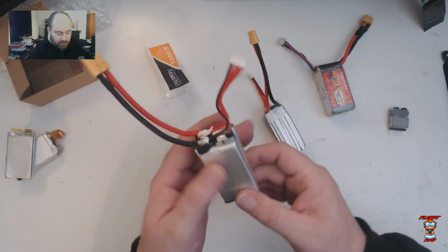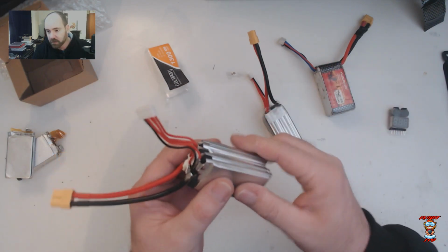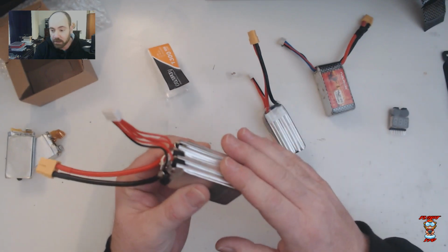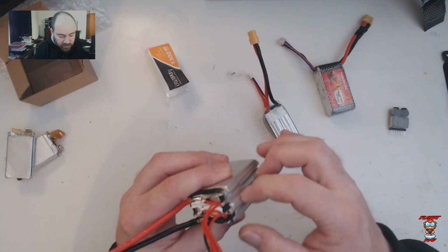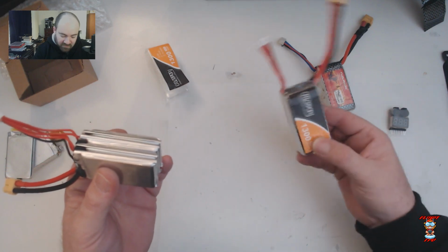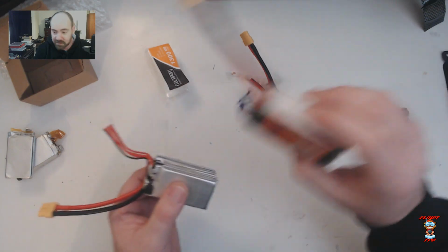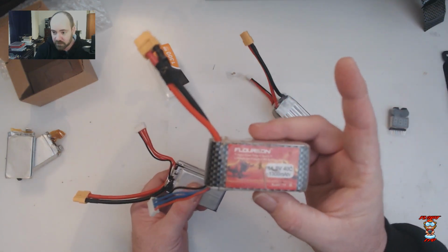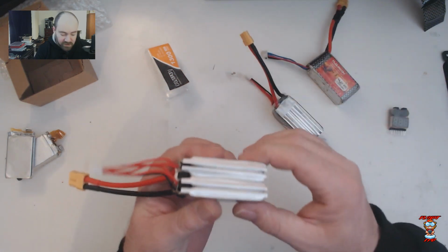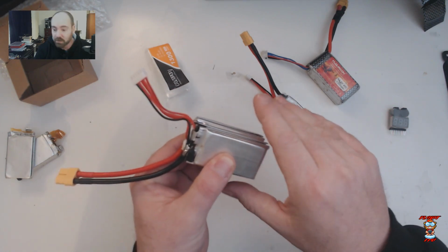So okay, in the next video I'll show you a non-scientific battery sag test with one of my quads, which is a very high amp draw quad. It'll probably draw about 140 amps on a punch out. And that's a little bit over 100C, so that should not sag as much as my other Fleurions and my Turnigys and the 65Cs and the 75Cs I have. So I should see less sag if these are good quality cells. I'm not very optimistic, but we will see.